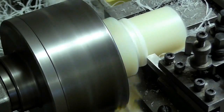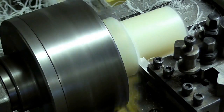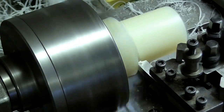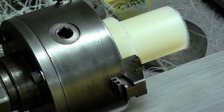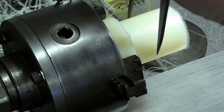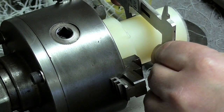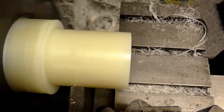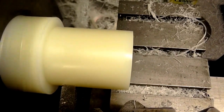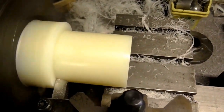You can see how much material I've turned down — the portion in the jaws of the chuck is quite a bit wider. That shoulder there gives a nice stopping point for the tool. We disengage the power feed and just finish it off by hand. We'll come in now and do a final measurement — I suspect there's very little to come off now, if anything. We'll bring the dividers in, which I've got set to the dimension we're turning to, and use the vernier caliper for a more accurate measurement. This is the final cut — just taking it down to the final diameter — and you can probably tell there's hardly anything coming off.